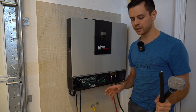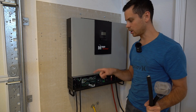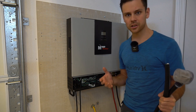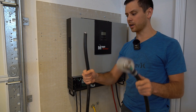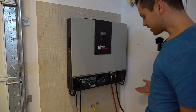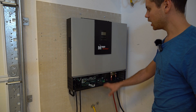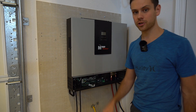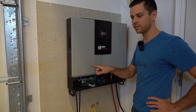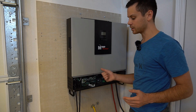The hardest part in building this system is mounting the solar panels and running those high voltage lines inside to your unit. Besides that, everything is so simple — you don't even need a sub panel box. You just connect a cable straight to your charger and you're set. If you had a stack of server rack batteries below this inverter, and then this inverter to charge your Tesla, that's fantastic.